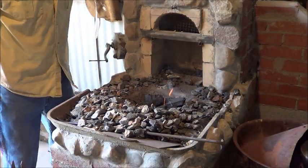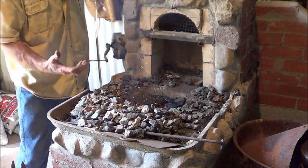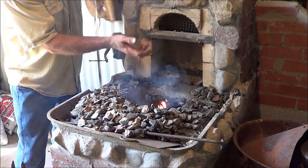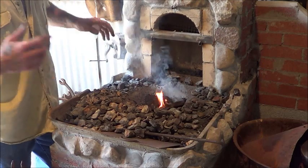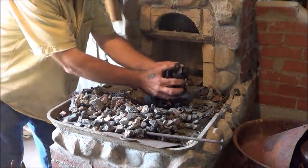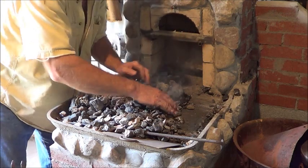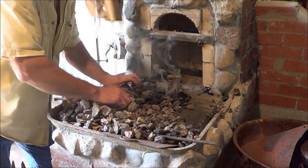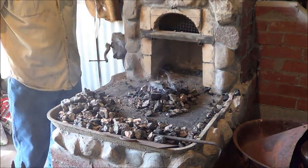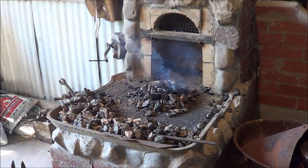Once I know the charcoal is lit enough to start my coal, if I turn that blower on you'll be able to see all the sparks that come out - and some of them do escape over the top. That's what scares me inside the facility. We're actually starting to get a little bit of draft now, but I didn't warm the chimney and it's hotter than hell outside. So I get to that point, throw some fresh coal in, and start tucking it around - I got to leave enough air for the whole thing to breathe. I tuck it into a nice little pot like that, and even now if I turn the blower on we get sparks that escape. That's where we get the spark box on.